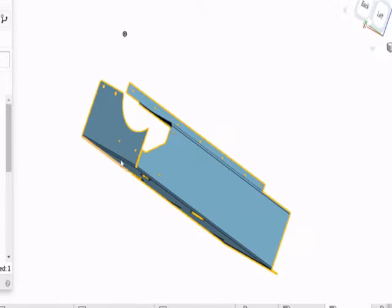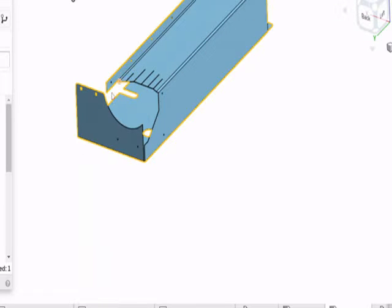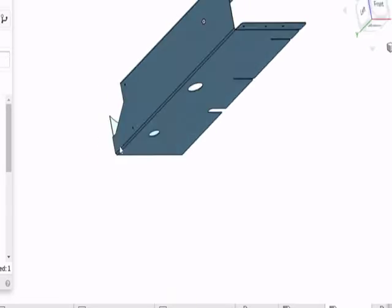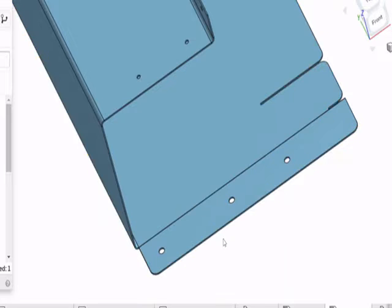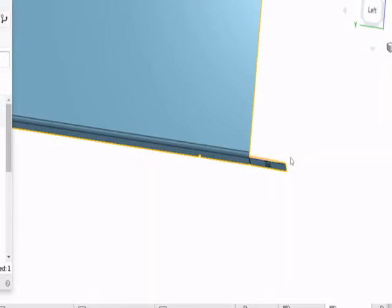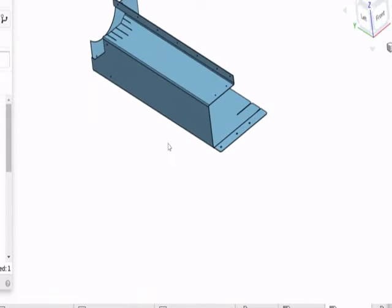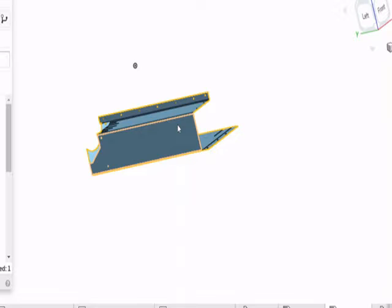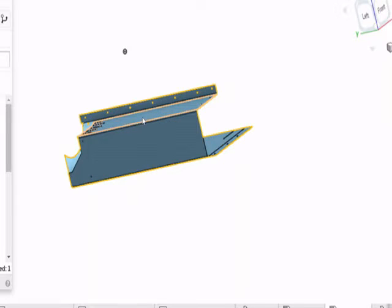There's an end cap here that bends up to fit around where the air comes from — I think the intercooler back into the intake manifold. There are holes in here for the ether line coming up through one, and then there's a sensor line — some kind of temperature sensor or pressure sensor. There's a flange on this end down here that looks like it might require a bend, but in fact it doesn't, or the bend is so slight it's just going to fit underneath another piece and they kind of overlay each other. One thing about doing this video: I don't have the tools I usually show for making bends. You can watch those on any of the other tin bend videos for the 9770 or any of the other combines.